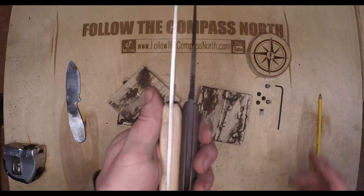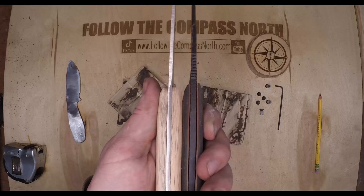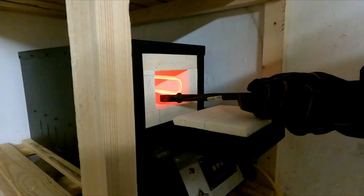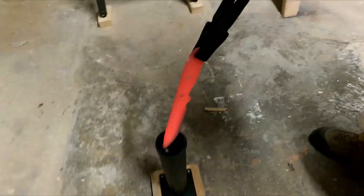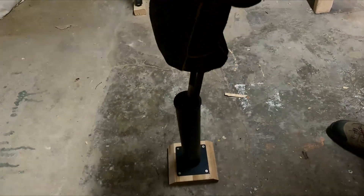When you put these side by side you can see that I made a thicker handle on the Damascus knife. I think the ESEE-4 knife handle is just a little bit too thin. Finally my 24-inch Paragon kiln has arrived — we heated this up to 1500 degrees Fahrenheit, let it soak for an hour before quenching it in some oil. It's important to keep the knife moving at this point so it doesn't create an air envelope around itself and protect itself from the cooling process that we want to take place.